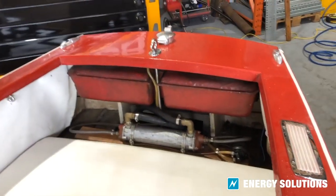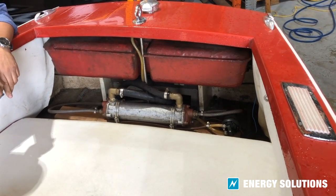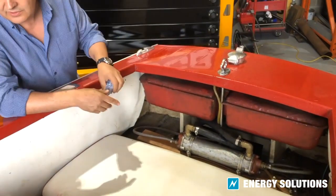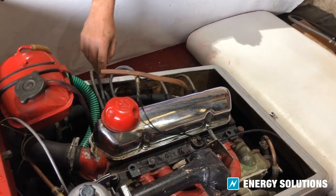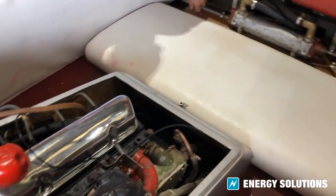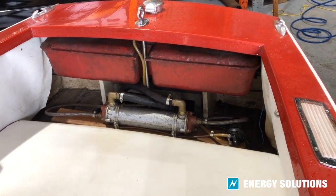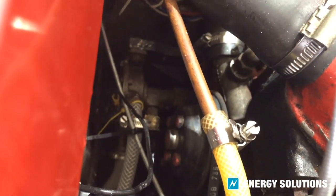We've got a heat exchanger here, so I'm presuming one side has got the seawater circuit or freshwater circuit and the other is the engine coolant. The larger diameter pipe is piped up to the engine coolant pump, and then we've got some smaller diameter pipe trailing through to the front of the engine, where there's a small impeller pump mounted. So that will be driving the seawater side of things.